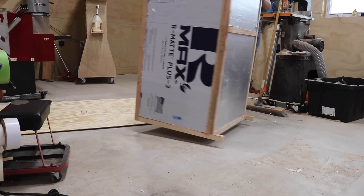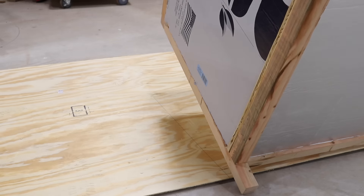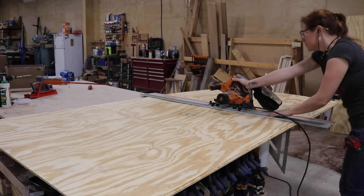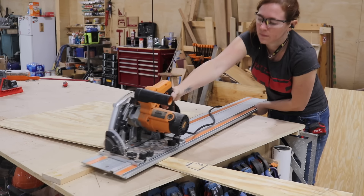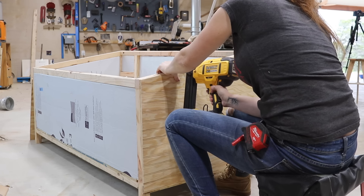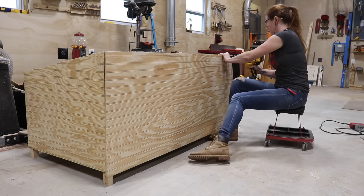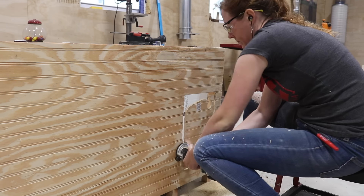The set-in-place and tracing method works so well I repeated it for siding. For the siding I'm going with beadboard — it's a huge pain to paint but it gives good texture and is very lightweight at only three-eighths of an inch thick. I dragged the full sheet over to my work area then flipped the house around to trace all the sides — just make sure the horizontal reference is squared up to the beadboard so the panel doesn't come out wonky. After tracing, I used my track saw to cut all the shapes out, then Titebond 3 and brad nails to stick them in place, starting with the two side panels so the front and back panels would cover their edges. On the front panel I covered up the opening with beadboard, then after securing it I used a large drill bit to punch a hole through and a router with a flush trim bit to perfectly cut out the opening.